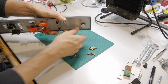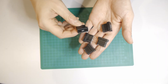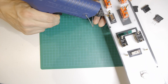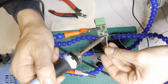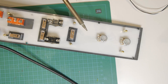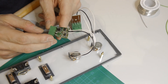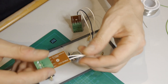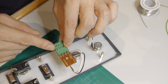The backlighting panel is held in place with 15mm hex standoffs. Then 5 annunciators will be needed. The wires on the dimmers were very stiff, so I changed them to more flexible ones. I replaced the original cables with three new cables between the dimmer and the potentiometer. With these new wires, I will be able to place the dimmer on top of the backlighting panel to connect the controlled LED power onto it.